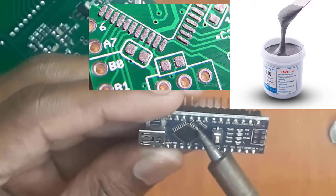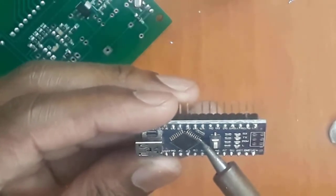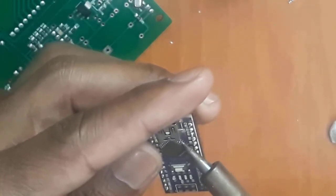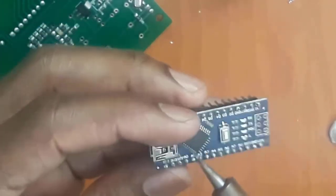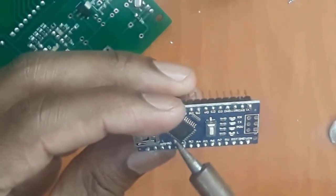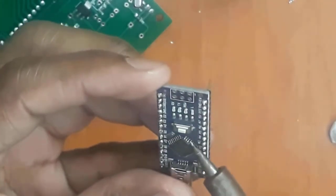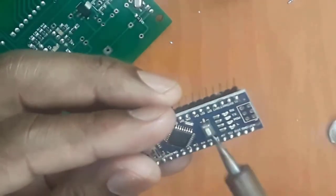If you have the tool to remove and replace another one, you can also do this manually, doing exactly the same process that I've explained now, by applying quick enough and removing. Don't keep it for too long, so that you can just achieve a good soldering melt point and a reflow happening without eating away your flux, which will make removing oxidation a difficult process. And like right now, you can see I'm just repairing this soldering or making it better to make sure I restore this chip and don't create dry joints over time. So that's exactly how all these things are done.